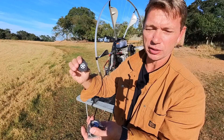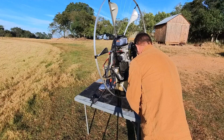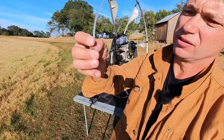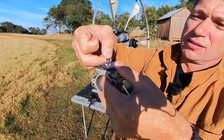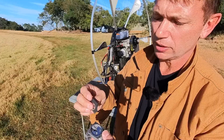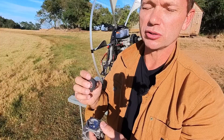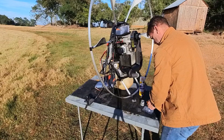I'll see if I can find a picture for you since I don't deal with those Walbro kits. It needs to be the correct one — otherwise it doesn't hook into the little fork correctly. This little thing is supposed to hook into a little nipple — it should grab onto that. But we don't do that on Nirvana's. We have a computerized engine and a lot less hassle when it comes to carburetors. You do not have to test for pop-up pressures. You just need to install your membrane kits correctly and make sure that little ring has been shaved off.